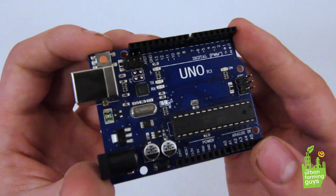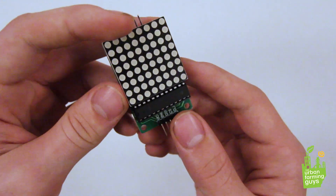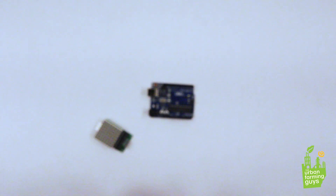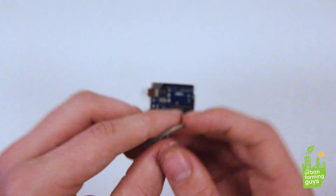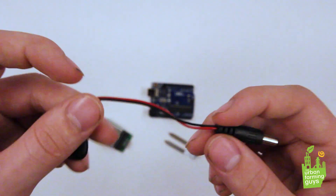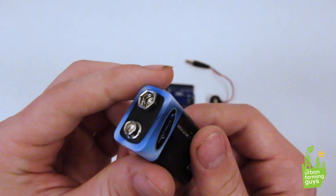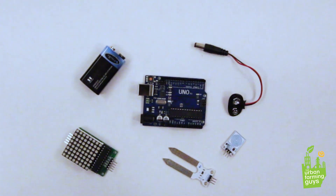Apex will plug into any plant and display the happiness of the plant based on its soil moisture. As the plant dries out and the soil moisture goes down, Apex will look sad, but if there's plenty of water, Apex will look happy. It's a simple project that will teach you the basics of Arduino, how to code, and also some simple wiring and soldering. First up, we're gonna need an Arduino — this one is a cheap Chinese knockoff but it'll do the job. Next we need an 8x8 LED display — it's important that you have the 5-pin version for our code, so make sure to compare yours to the one in the link below the video. We're also gonna need a moisture sensor, a capacitive touch sensor, a 9-volt battery Arduino connector, and a battery.